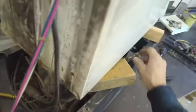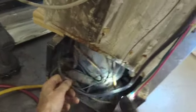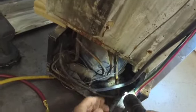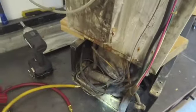So the wires disconnected here. Okay, this is disconnected here, and I believe that's it. Drain heater's disconnected. The drain tube is attached there. So now this is the wire coming out. That's for the water valve. We have to now disconnect our heat exchanger so we can fix that, and also we'll cut out the dryer and unsweat this condenser line and just pick the whole thing up.